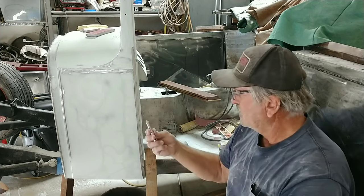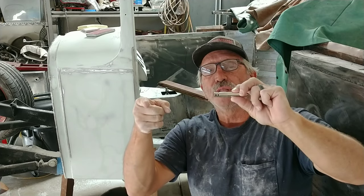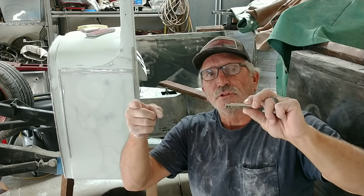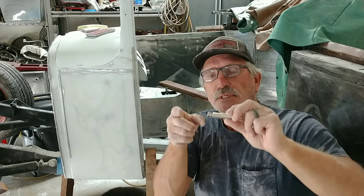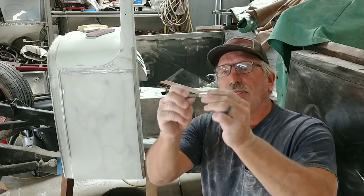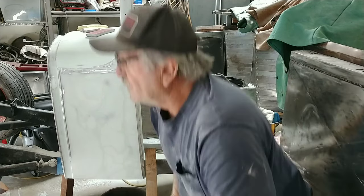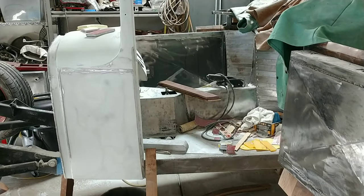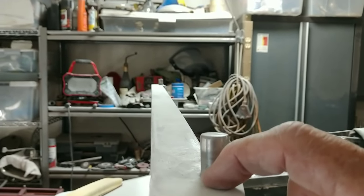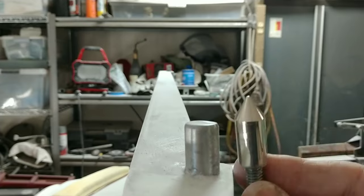As you can see, this pin goes inside the solenoid. There's a spring that attaches to this point that goes to an arm, and when the solenoid fires off it pulls that arm back so you can rotate through the turnstile, then the solenoid drops out and the arm shuts against the lock mechanism. I took this and milled it down and put threads on it — it's 5/8-18 thread — so I'll end up cutting the old pin off, then drilling and tapping it, and replacing it with this.